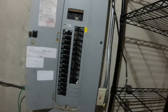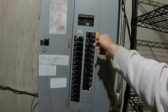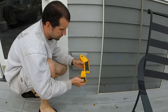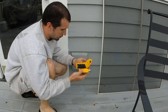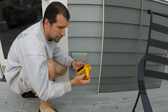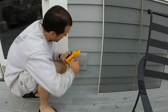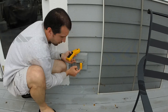Another thing you can use is a particular tool that will actually put a signal through the wire and you can scan through it. I bought this at a standard hardware store. This little device you would plug into your outlet and it sends a signal down. Then this is a little sensing device that, when you go back to your circuit breaker, you can try to figure out where it's from. I'm going to go ahead and plug it in — it's already making some kind of racket.